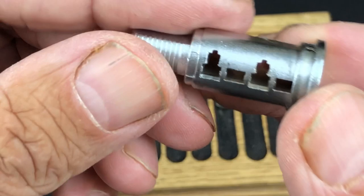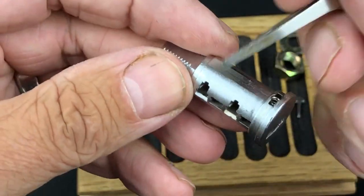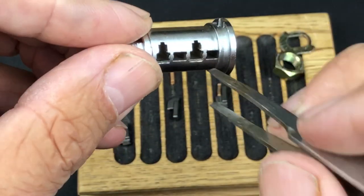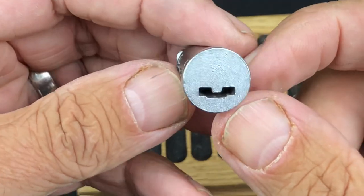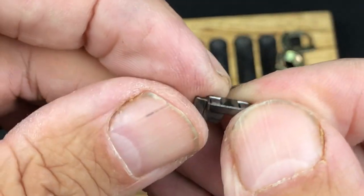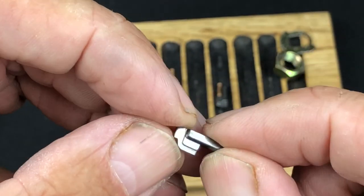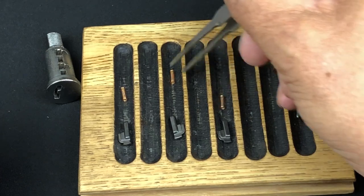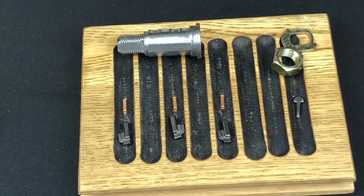You can see the lock body with the four cutouts there. I believe some versions may have four sliders and some three, or they may just orientate the sliders differently to keep people on their toes. Where the sliders sit on the bottom plinth there's not a lot of material, because the magnet needs to pass through that as well — quite an interesting design. All the sliders are the same; they've probably just got the north and south poles orientated slightly differently. They're steel — probably hardened steel — and we've got these little brass springs which make sure they don't interact with the magnet side.